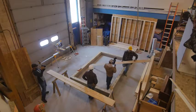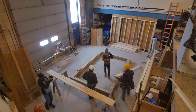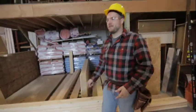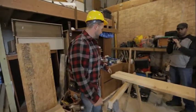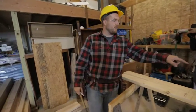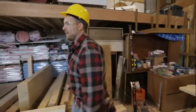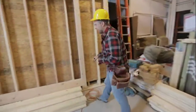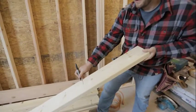What we can do is take our whole pile of floor joists. From our layout we knew we needed 12 full-size joists — we counted them out: one through twelve. So we'll come over to our pile and just crown all of them. Some of them have already been done, but you just sight down every board, determine which way the crown is going, and make a mark.